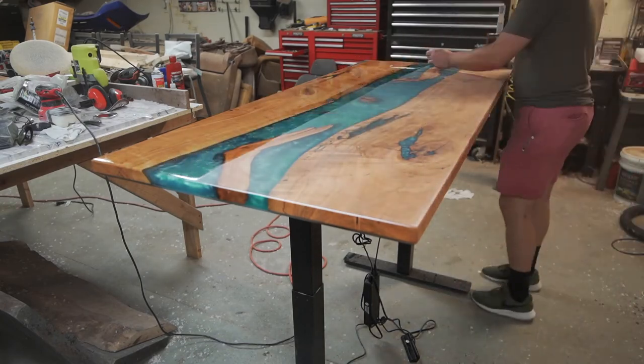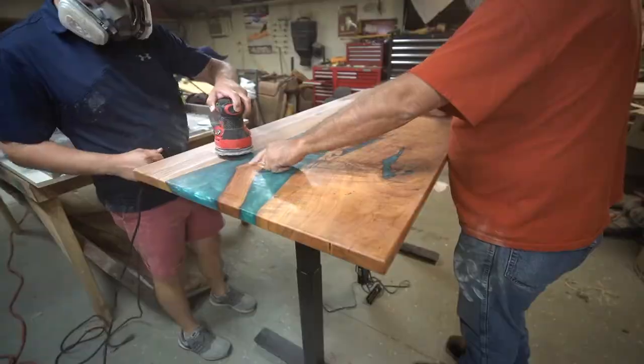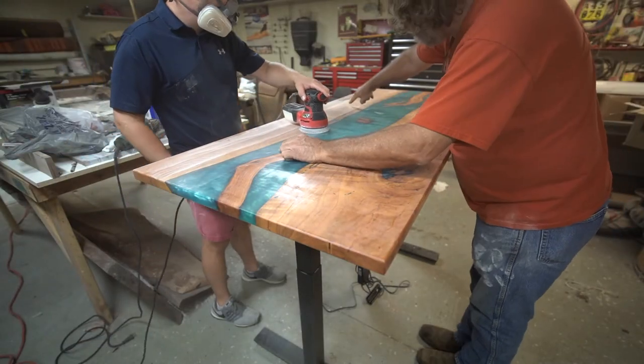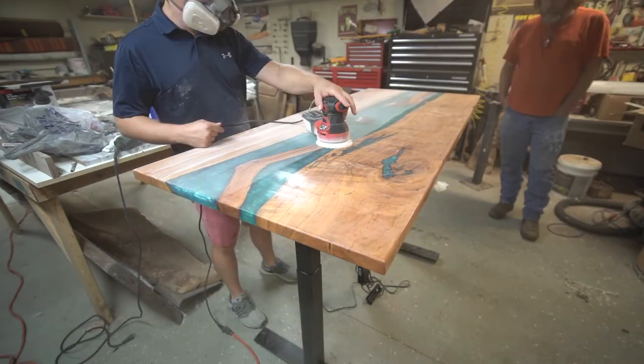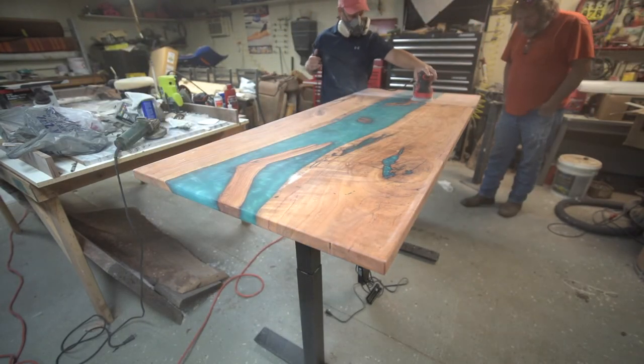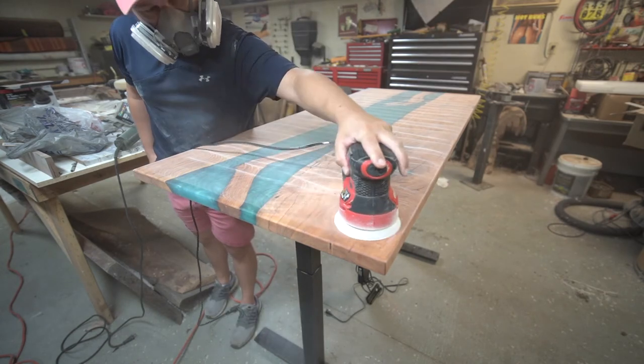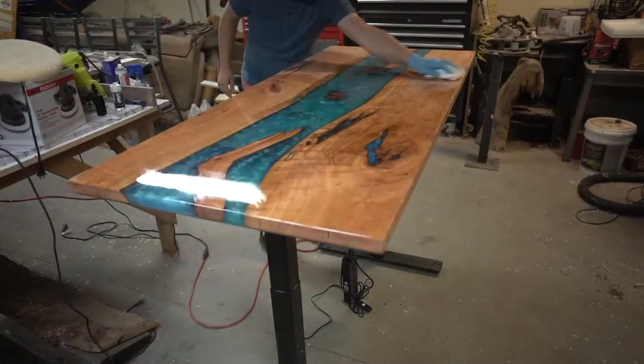So, I decided to use an oil-based polyurethane satin finish, which is very far from the most popular choices here on YouTube. My idea behind this being that I wanted the protection similar to epoxy, but I wanted a finish similar to Rubio Monocoat, which is what I use for my entryway table, and it's literally a fraction of the cost of these two.